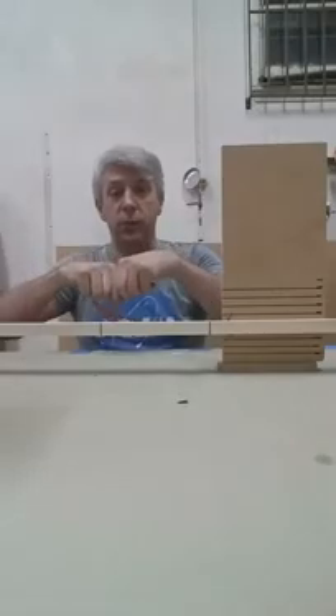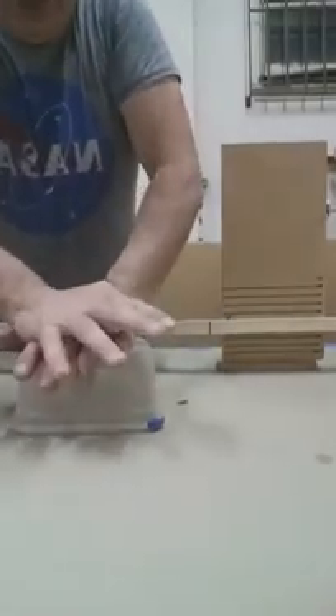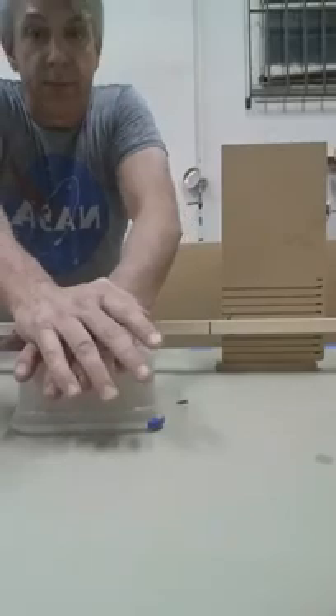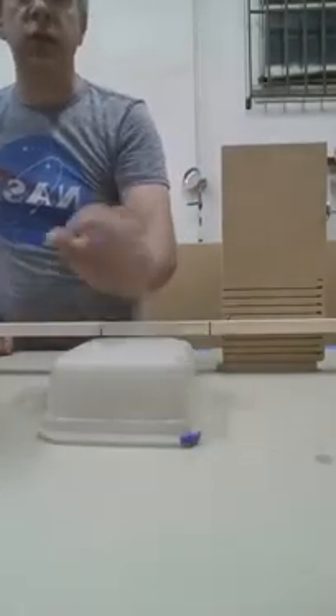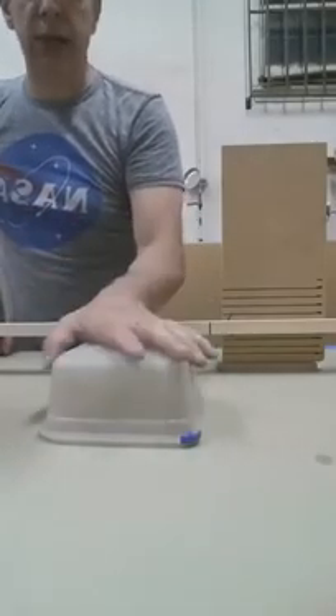The reason I do that is because by putting the material on edge and connecting it to the baffle lines — say this is the flat section of the baffle — and I take a piece of wood and put a right angle to it around the entire perimeter, it's now incredibly strong. I could actually get up on this table and stand on this, and this is just a thin piece of plastic — that's how strong this object is, and that's because of shape.